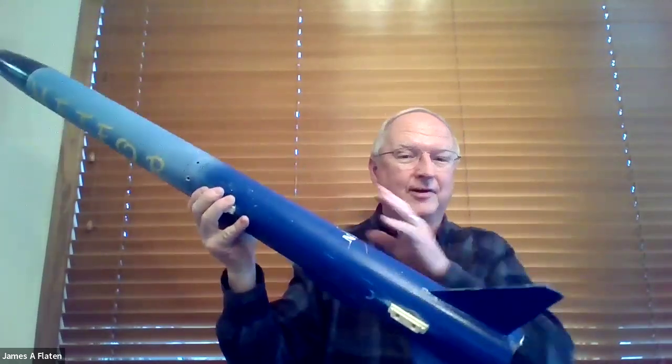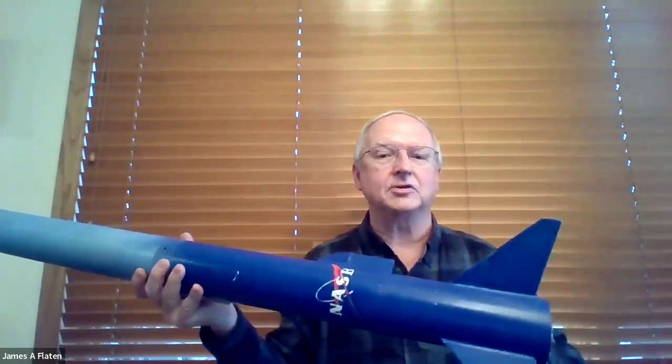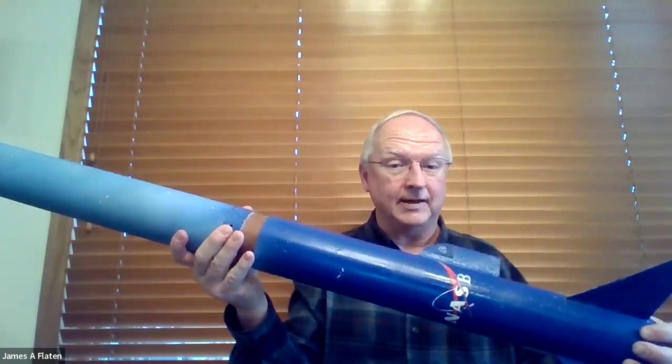Here's a quick comment: why would a rocket separate? If you fire explosions, you want the rocket to separate in the location of the explosion - that's appropriate. But rockets can come apart too early. One possibility is that the upper section of the rocket, the nose cone in particular, is more aerodynamic than the lower section. This rocket has something sticking out here giving it drag, a camera pod giving it drag, and fins giving it drag. So you can have drag separation. The rear of the rocket has more drag, the upper section has less drag, and the two parts want to fly somewhat differently. You need to make sure that your friction fit is tight enough that this natural drag separation - which will be a few pounds, not a huge force - doesn't pull the rocket apart right here.